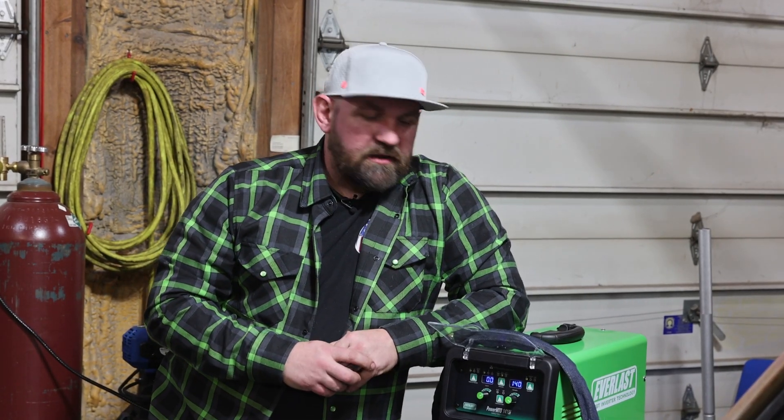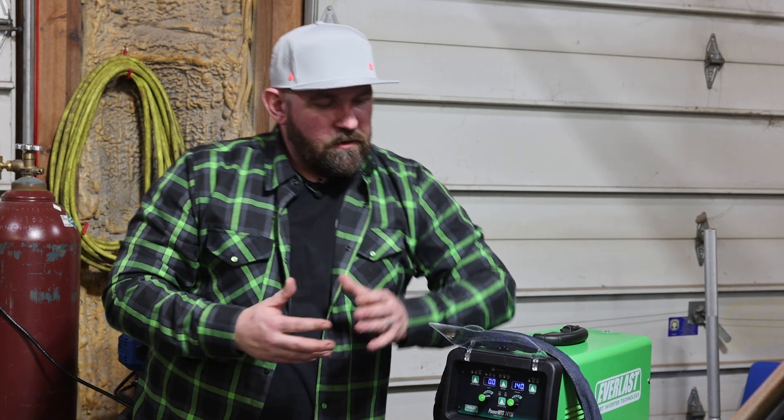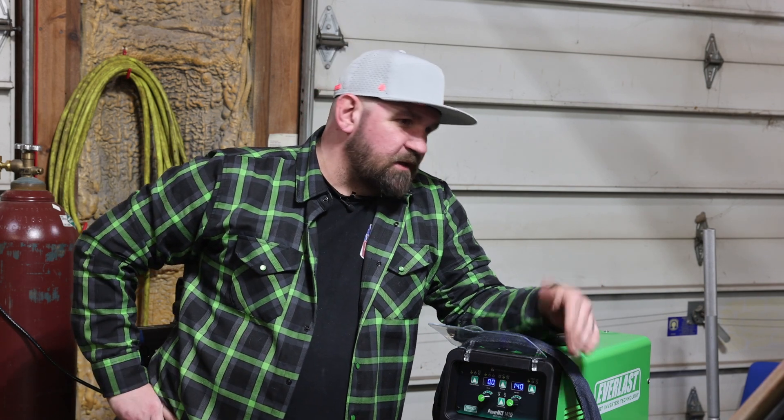So we're wrapping up with this chassis work today. In a previous video, we showed this thing running a spool gun — sub-thousand dollar combo — doing some really nasty aluminum work. And today, same machine doing some real fine precision TIG work on this chassis. If you're looking for a handy little machine to have on a work truck, service truck, or around the farm, this thing will do it — the 141 SI. We ran the spool gun on 120 volt, 20 amp breaker, never popped the breaker running 140 amps output. Today we welded up 10 to 15 tubes and never popped the breaker. Really powerful, really handy little machine — the Power MTS 141 SI. Check it out. I'm Jesse McCollum, Weld Mean, Weld Green.